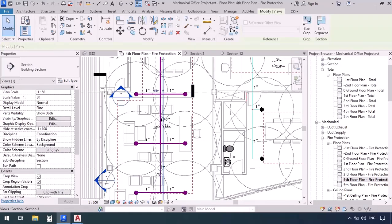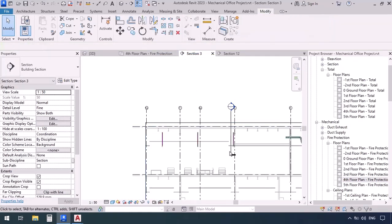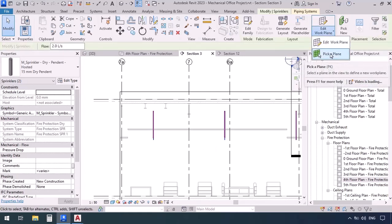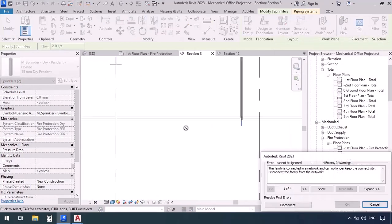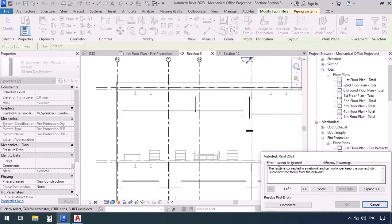Now what's going to happen to the sprinklers? I'm going to take a look in this section, right-click and go to view. This is the first one we drew, but we copied these two. So I'm going to select the two sprinklers, then go to edit work plane and pick a plane. Remember that in lower versions this 'pick a plane' may not exist — just click on edit work plane. Pick and click OK. Now you have to pick your plane. Now that this pipe is moving and being repositioned, we get an error saying that this connectivity cannot be kept.